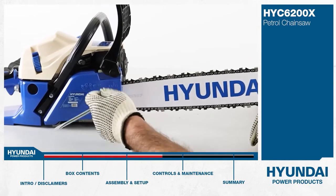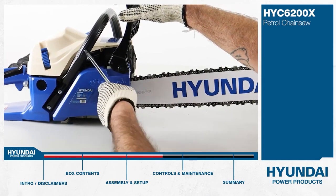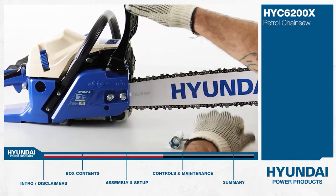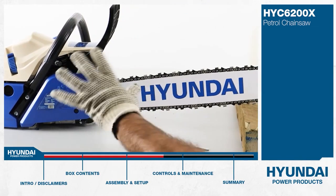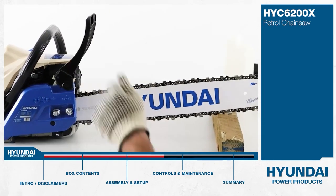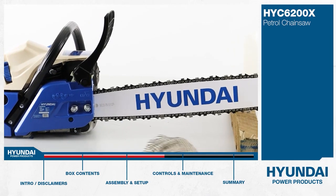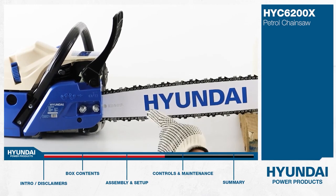So, with it in that mode, I'll retighten the 2 nuts, nip them up first. Okay, that one tight, and that's that one tight, and put the chain brake on. Always a great practice whenever doing anything with a chainsaw, if you're not actually cutting, and leave the chain brake on. Once you've started the engine and you're about to cut, that's when you take the chain brake off. Okay, little safety tip there. So that's the first adjustment of the chain.